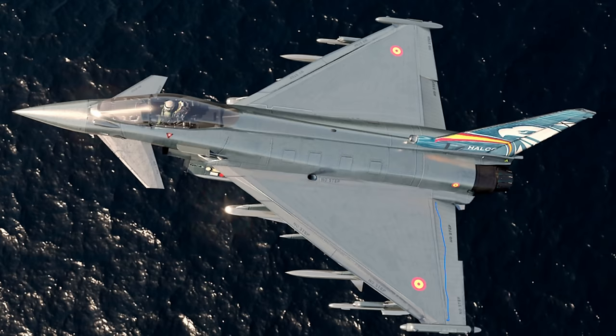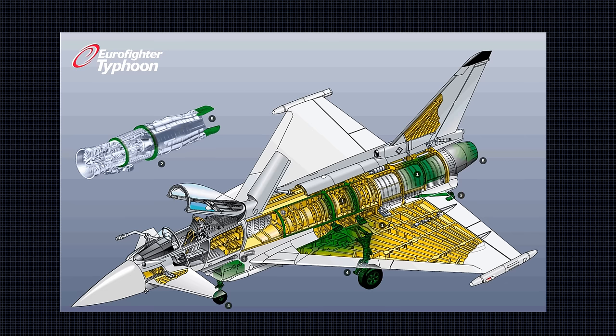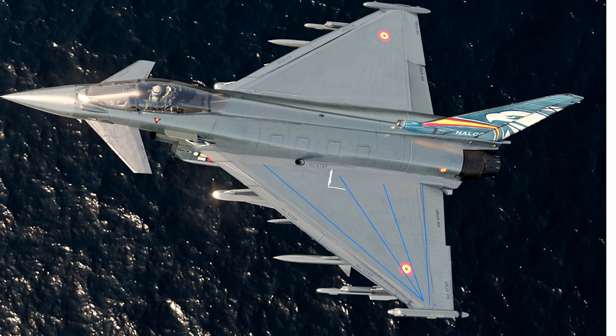From a structural point of view, the Eurofighter is quite an interesting aircraft. The wing structure in particular is quite different from other deltas — it is not possible to identify main spars because there are several spars, all radiating from the wing tip at different angles with the aircraft axis, all more or less the same size. They are attached to a thick root rib that closes the wing box. The wings are mated to the fuselage with three large joints connecting a thick box inside the wing — housing the undercarriage — with three large bulkheads in the central fuselage section. So there is no structural continuity between the two wings, and yet the aircraft is considered very stiff, which is a distinctive characteristic of the Eurofighter. This is a surprising solution, but clearly it works.